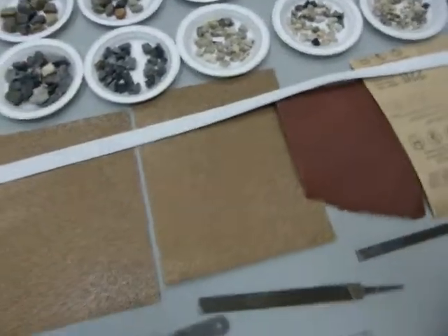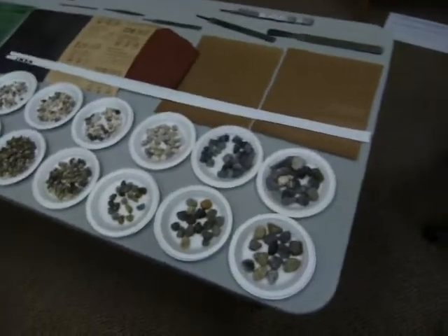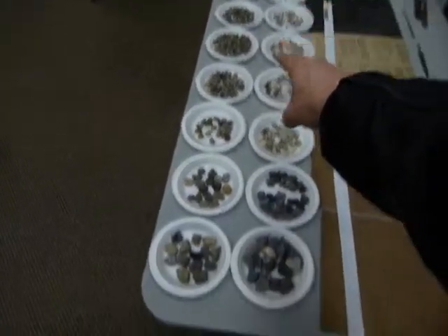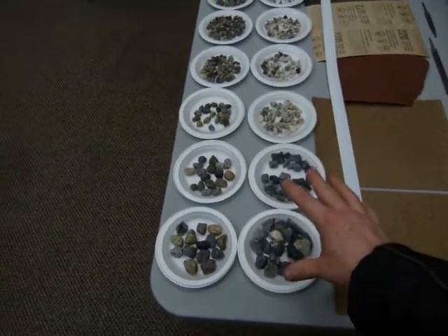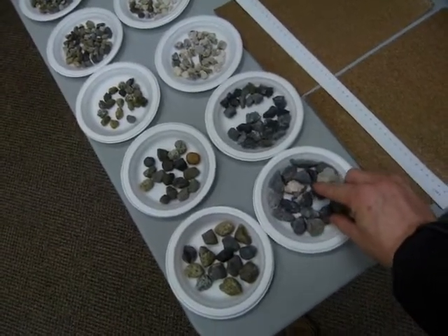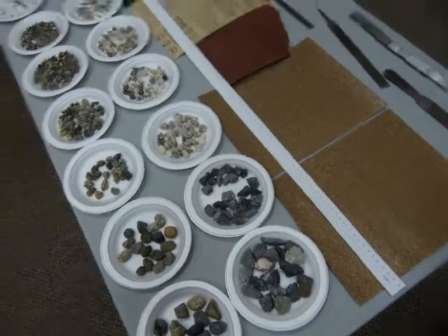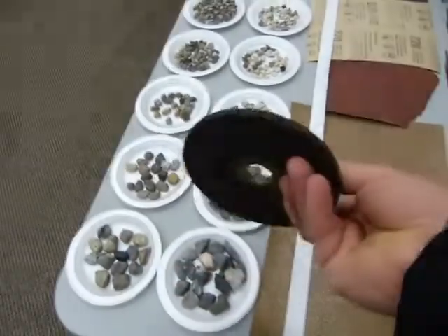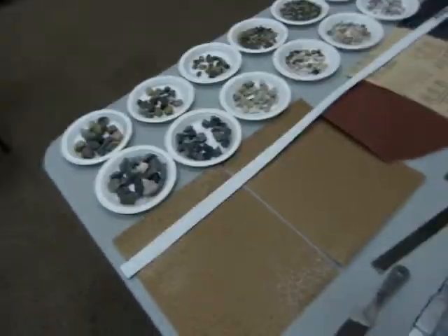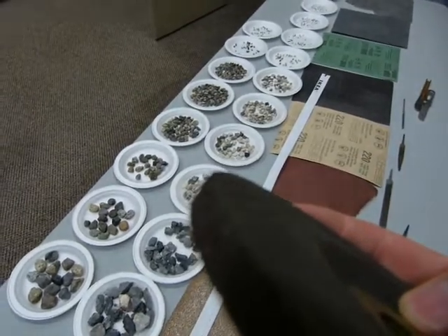The right way and the wrong way to sand can be illustrated with these two rows of rocks here. In this line, going all the way towards the open door, I have crushed rock. This represents — not for its physical size, but for its nature — the size of abrasive rock that gets glued onto a sandpaper. There's not much more to sandpaper making or abrasive disc making; these numbers refer to the abrasive particle size in the product.